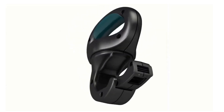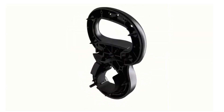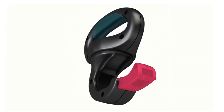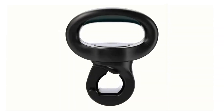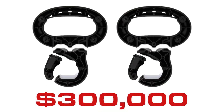With this part, you can see it's composed of about six injection molded parts, maybe more depending on how many internal pieces it has. You have the handle, the main hook, and then the little clasp over the main hook, each needing two molds to make them. Those molds would range somewhere between $20,000 to $50,000 a pop, giving you about $300,000 in molding costs just to get set up.